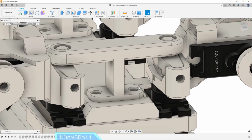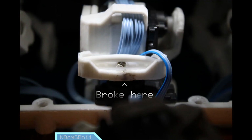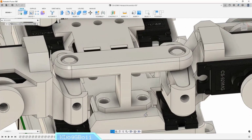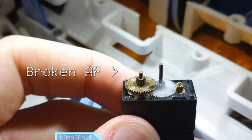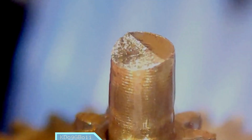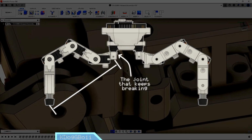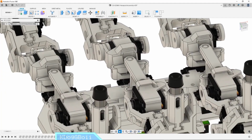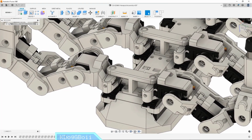Unit 0 also has purebred dog levels of hip issues. Firstly, the plastic joints on these parts are too thin and kept breaking. Sorted this out with some simple bulking out. Second, the potentiometer shaft in the servo motors kept breaking, likely due to the machine being designed so that there was the greatest turning moment possible applied to the servo output. To fix this, I have modelled hip support components to try to provide some support to the hip.